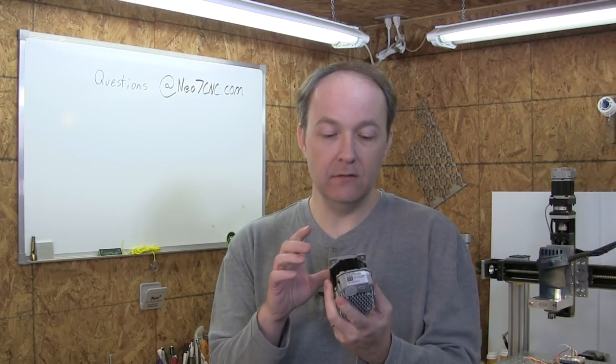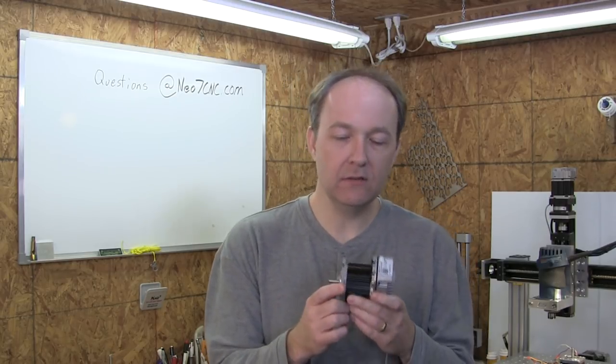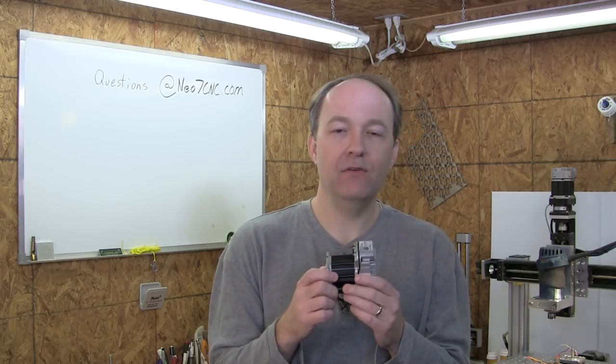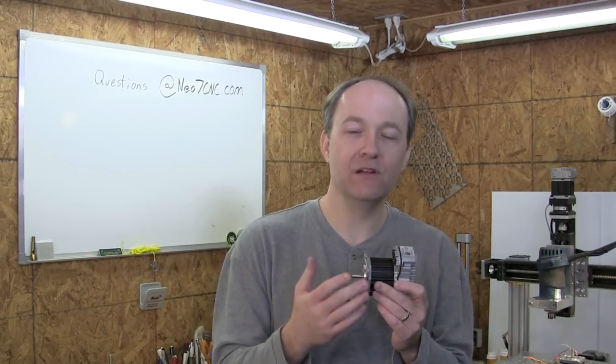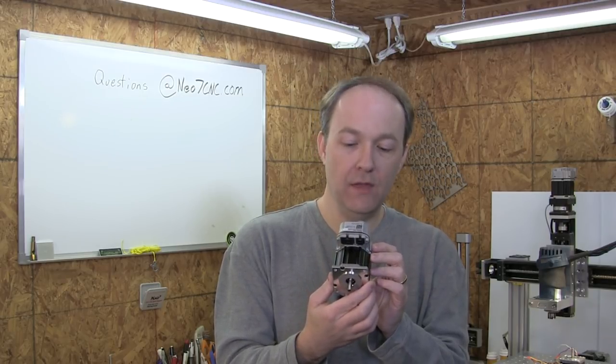I want to go over some of the reasons that I went with this. And one is speed. They're extremely fast. I was able to get the table front to back on the CNC machine to basically dial it in and just stop tuning it at 500 inches a minute. And when you only have 9 inches of travel, that's pretty fast. So if you've seen the cut videos, that doesn't really do it justice, because I have to worry about a bit going through the material. The machine can move extremely fast, and this very small but very powerful motor moves it with a lot of authority. So how is this different from a stepper motor?